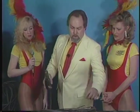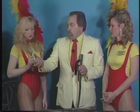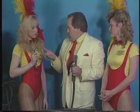And first I should tell Christine, that was a question that you asked Sunday, is why would somebody stick weld instead of gas weld? And what we pointed out during the time we were practicing is that gas welding isn't very practical when you get over 1/8 of an inch thick steel. It takes too long to heat it up, Angie, as you recall.